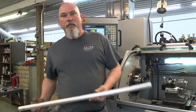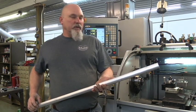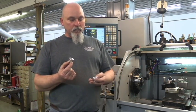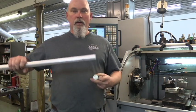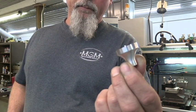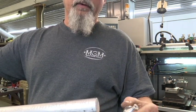The part starts from a bar of aluminum — inch and a quarter diameter aluminum bar stock, 6061 aluminum. Machines really easy, easy on tooling; inserts last a long time. What we're making is the knobs that go on the top of the three-piece ram rods. So our first operation: we've got this bar in the lathe, it's turning, and we're making this shape on the end. Then we part this off and get this piece. It's stuck on the end of the bar just like that and I reach in and break it off, so it doesn't fall down into the chip pan with all the chips and swarf.